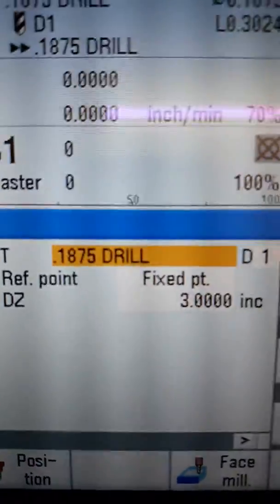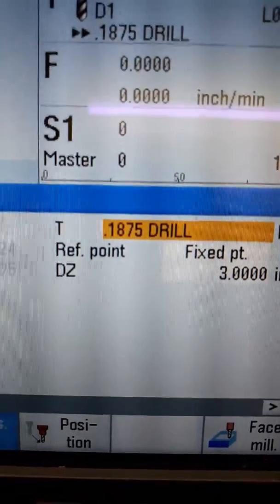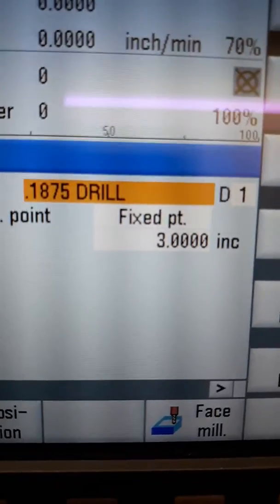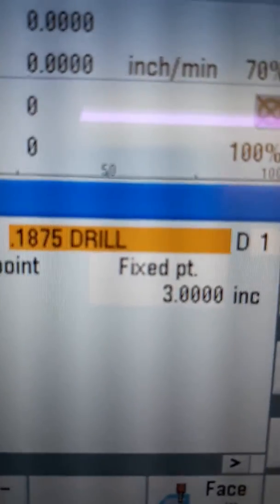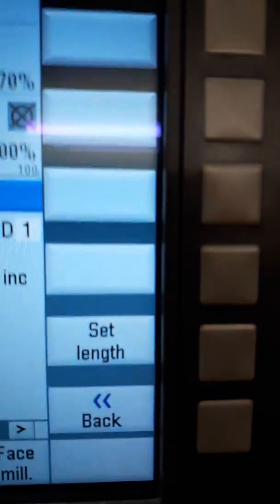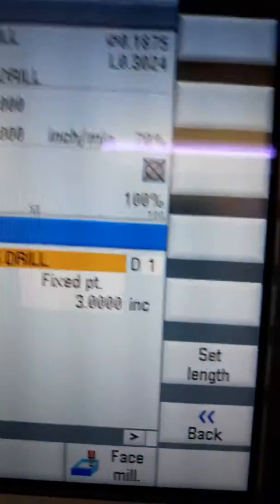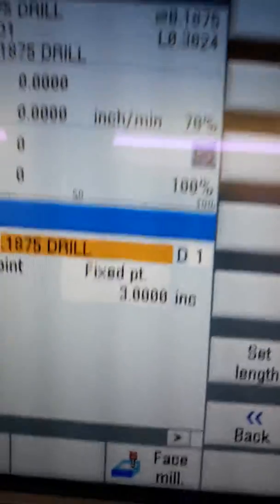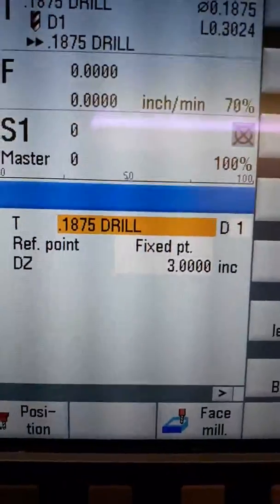So now you're going to drop that down to some point of reference. I use a simple analog tool setter and bring it down — I set that on top of my table. You can see where I have it set at three inches, and then that tells it it's three inches. Then you see the button that says Set Length — you push Set Length and it's set. That's it. You go through all of your tools, pick up all your tools like that, and that will put them all in your tool table.